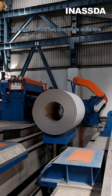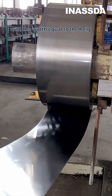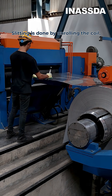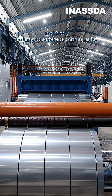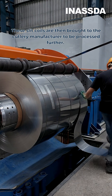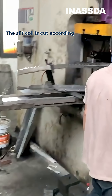To make cutleries, the wide coils are first slit into thinner coils with the width equal to the height of the cutlery. Slitting is done by unrolling the coil, slitting them, tidying up the edges, and then re-rolling into separate thinner coils. These slit coils are then brought to the cutlery manufacturer to be processed further.